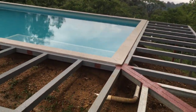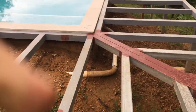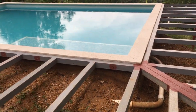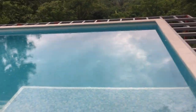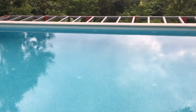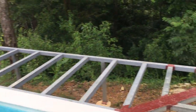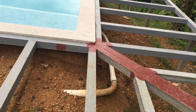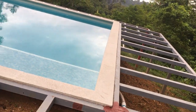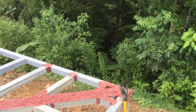This is where resistance comes into play. You can see the tube for the jets coming around to feed the last jet — one bank on this side, another bank on the other side, and three pumping up from the floor, for a total of 11 jets. This pool has excellent circulation and very low resistance with no elbows, no T's. Instead of a sharp 90-degree turn, I used a curved sweep and then another curve to make the 90-degree turn back into the jet.